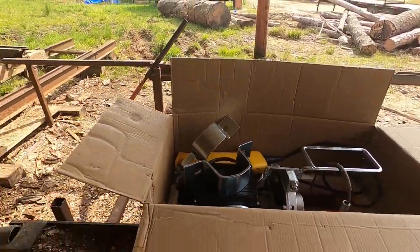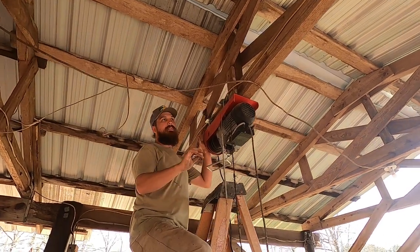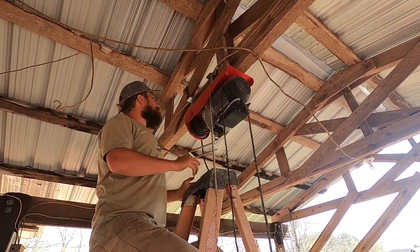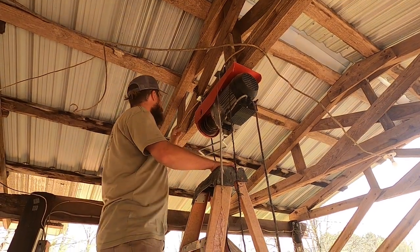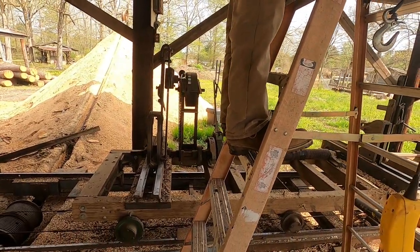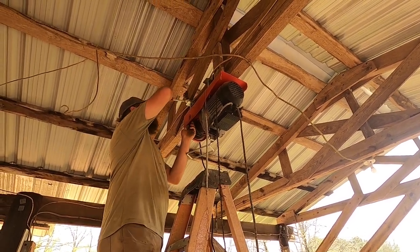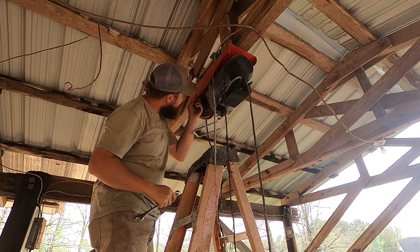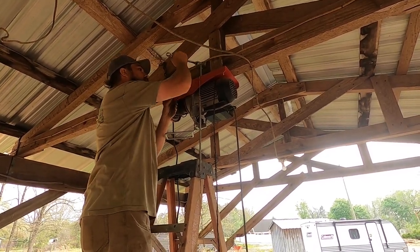I'm going to put it back in, and I'm going to try to move one of the things I had to complain about with this one. I had it offset a little bit due to how these old rafters were made. I've never had any issue with it pulling the rafter — it just rolls the log, not picking up logs, so it's not putting out that much force. But I had it too far back, and I really wish I could get it forward because it needs to be directly over the log, pulling straight up. So I'm going to drop this thing down — it's just four bolts holding it, screwing into a captured nut welded inside. Let me get these bolts loose and I'll bring you back.